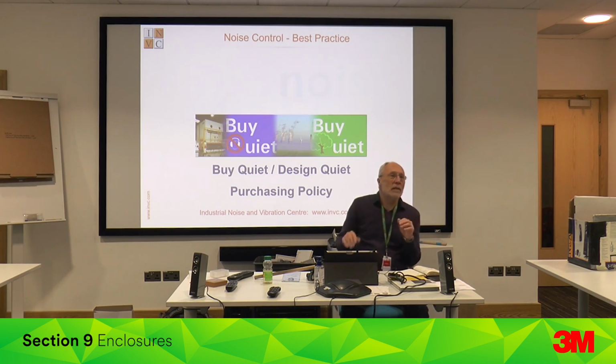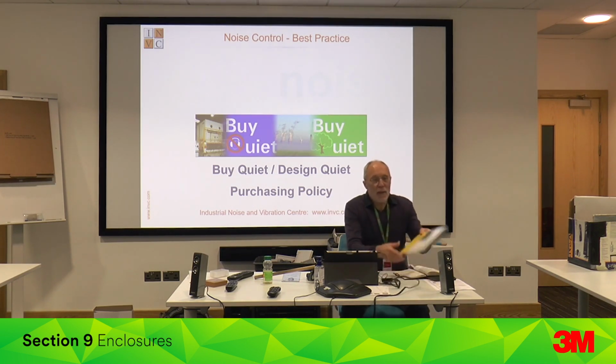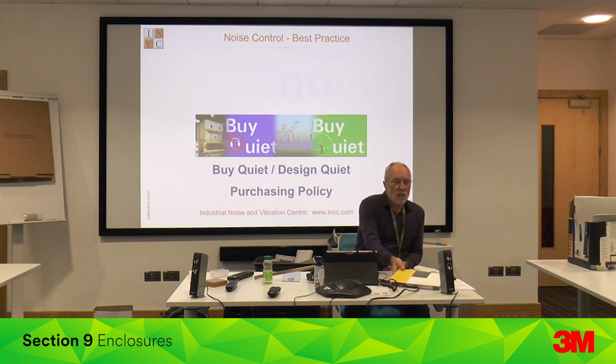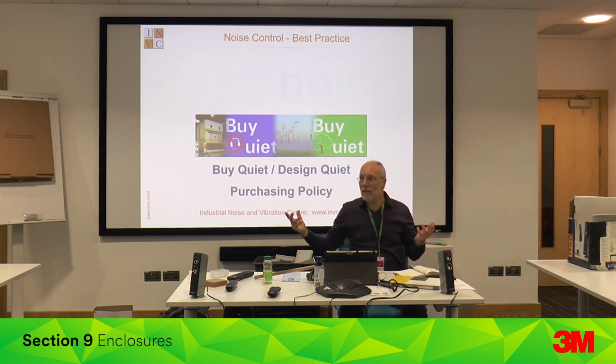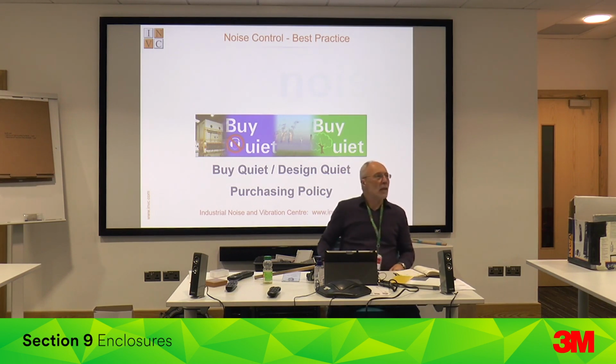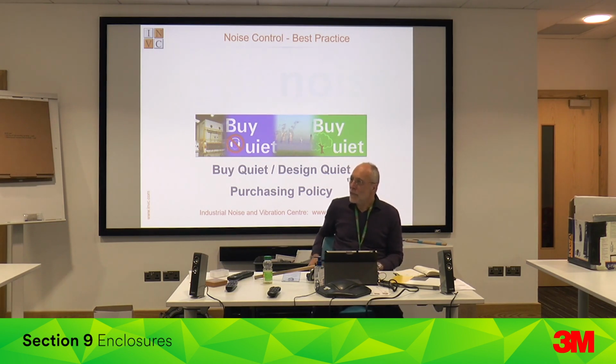And then, on top of that, put some of this inside at some convenient location that doesn't obstruct vision and doesn't get sprayed, which reduces the noise inside. With those measures, you can improve the performance of existing enclosures by 5 dB or 7 dB quite easily and very, very cheaply, without affecting anything. So that's really quite simple stuff as far as enclosures are concerned. So if you're in a polycarb enclosure and you just put that stuff on the ceiling, will that make a difference? Yes, it will. Doesn't matter where you put it inside.